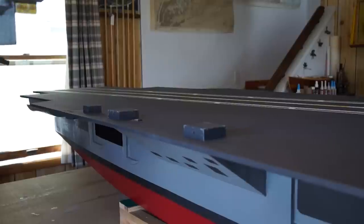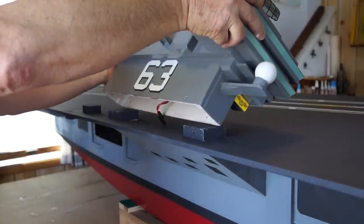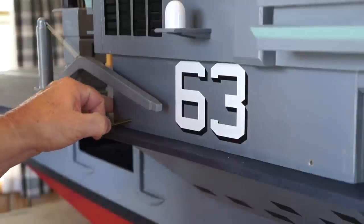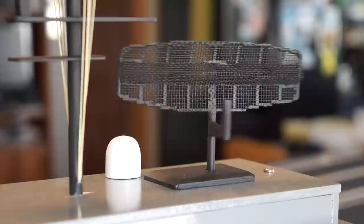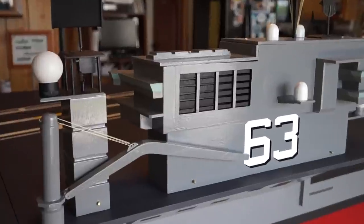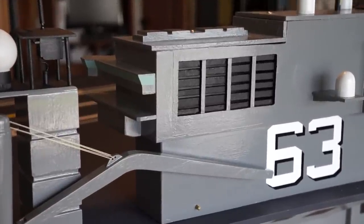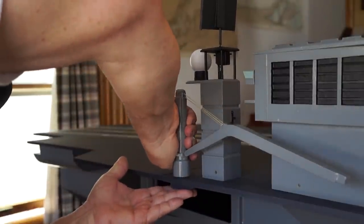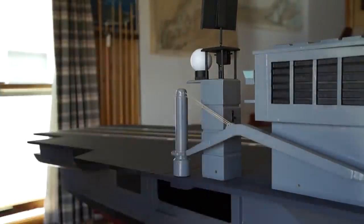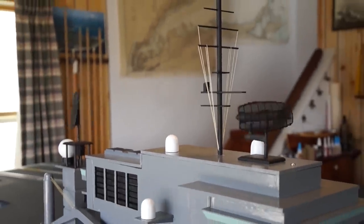The island structure is made almost entirely from 3/16-inch plywood and locks into place via a pair of brass pins at its base, between which sits the connection point for the radar power. That radar sail itself is fashioned from household window screening. Decals replicating the real ship's markings are custom printed, and stack-side air intakes are approximated with wood slatting — on our model, these intakes offer ventilation for the ship's interior. The crane base is a repurposed copper pipe, some of the radomes are ping-pong balls, while others are repurposed broom handles.